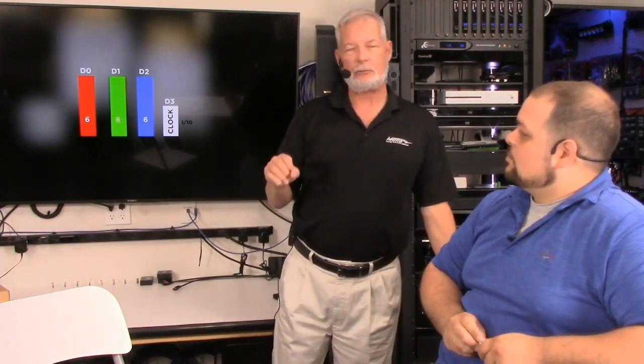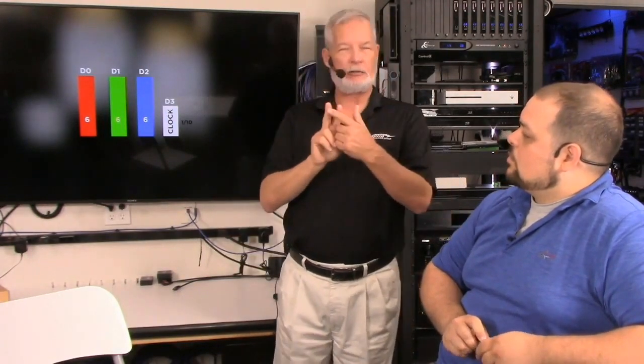The other side of it, particularly as you move into extenders and matrixes, is it's not just the bandwidth. The way the data is handled will be different under the new version than under 2.0, 1.4, 1.3, etc. So there are other changes happening. Typically, when you look at a panel or a device that has a 2.1 chipset in it, there's going to be at least two physical HDMI chips, an HDMI 2.0 chip and an HDMI 2.1 chip.